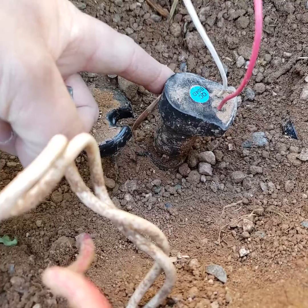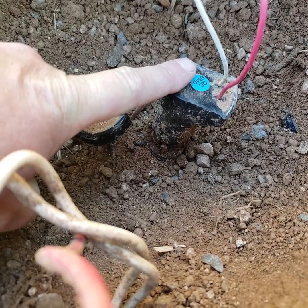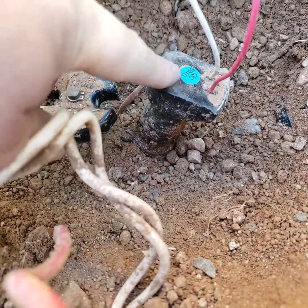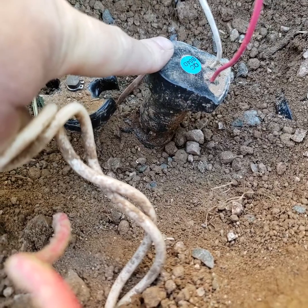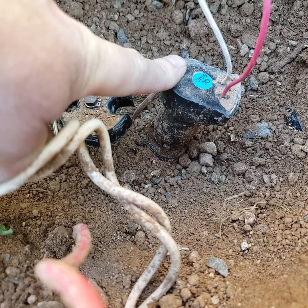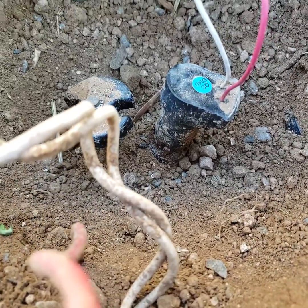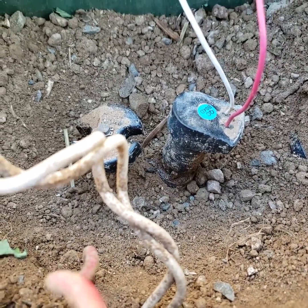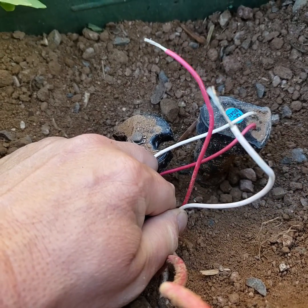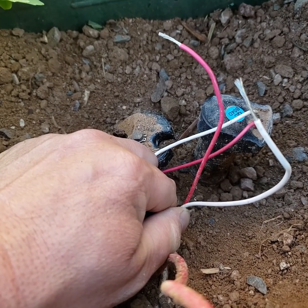The other reason is this is also a 3.5-volt give-or-take solenoid. So this solenoid being energized by 9 volts is eventually going to give out, and then you're just going to have an open line with no continuity.